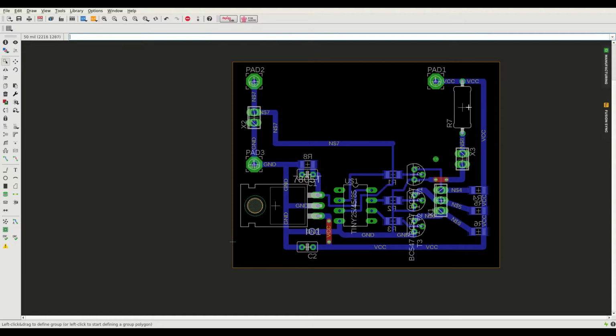This is the current limiting resistor for the LED. I have some spare pins on the controller. I'm thinking about making this a transistor and PWMing the LED, which would conserve power better than just having a resistor. And I think you can get away with it if you put some minimal resistance in the leads to the LED. You have a minimum resistance, and that will limit the current somewhat. You can just pulse it. If you're careful, you can get away with that. Although it is a bit chonky. Oh, I'm not sure. I think I'll just leave it at the resistor.